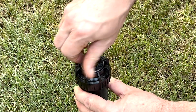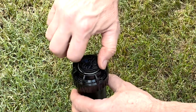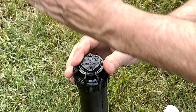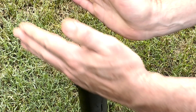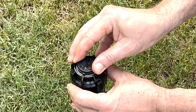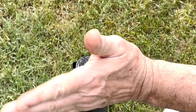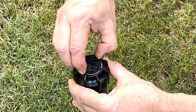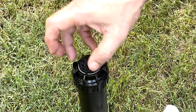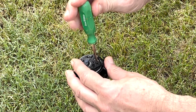While it's not running, you can turn this back and forth. On most heads you can do that as well, but we can change the left limit by turning the top of this head. If we want to bring the left limit to the right, we can continue to turn the top of the head and it pulls the entire adjusted arc this way. Or if we turn it the other way, it takes just a little bit of hand strength and pulls the entire adjusted arc back. So we can dry adjust our left limit, and even when you feel it clicking in its normal arc turn, you can see the entire arc.